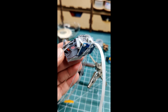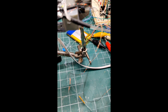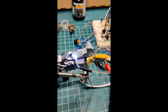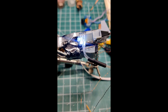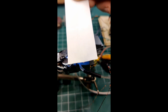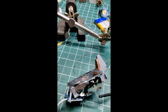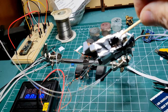I've mounted the OLED display and glued in the fiber optic strands. I'm starting to add the LEDs for the panel areas and I decided to use a more rectangular 1206 surface mount LED. There is also very little clearance between the cockpit and the outer body so I mounted the LEDs facing out and used some metal foil tape to diffuse and reflect the light back through the panels. I then used black liquid tape to cover areas that may allow light to bleed through. Working my way around the cockpit I eventually fill in all the areas where light is showing through.